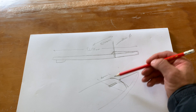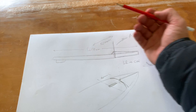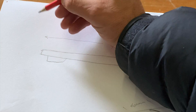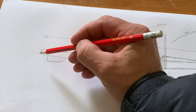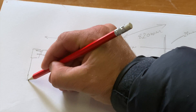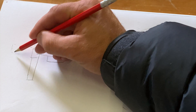In order to go sailing, we need a mast and we need a centreboard to provide lateral resistance to our centre of effort, which will be up in the sail. We also need a rudder. A couple of options there — what we need to do is square off the stern and add a couple of gudgeons and pintles. Remember, this is the test bed for the next design, so if it doesn't look as polished right now I'm okay with that. The rudder will have a box here with a pivot point.